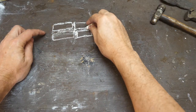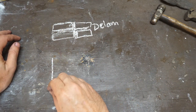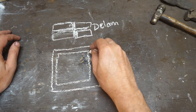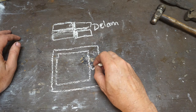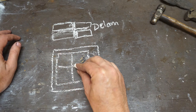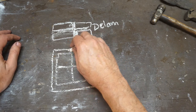I think there are three possibilities. The first is delaminations — where these just aren't really good welds and they're bright and open. I don't think that's the case; it's a solid piece of steel. The next option is that even though we welded in a canister, our billet didn't go all the way to the sides, leaving area for oxygen — just a small amount — that creeps into the weld areas and causes iron oxides to form.